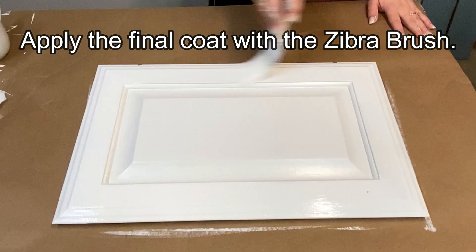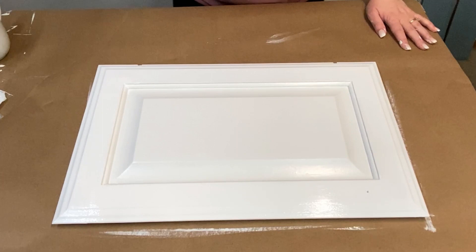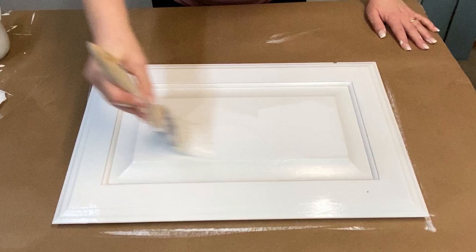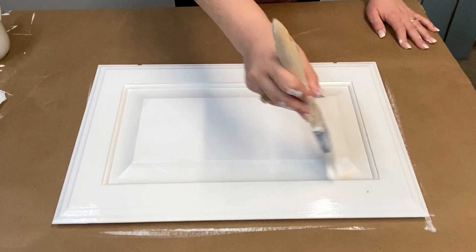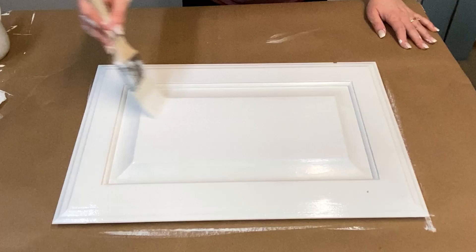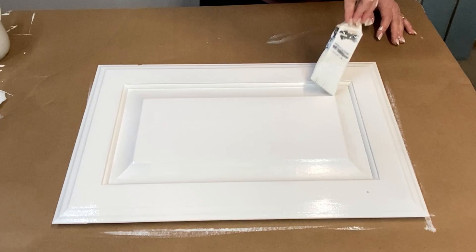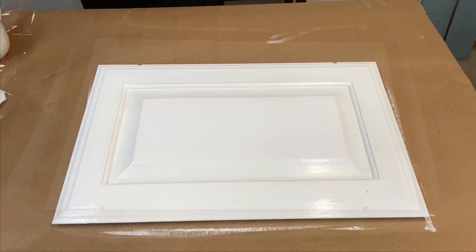Finally, we're doing the last coat of paint. Do this with your Zebra brush because this is the best way to get a super smooth final finish. When painting, always brush with the grain of the wood, especially right before you're done with that coat. At the end, be sure to wipe any drops of paint out of the corners so the paint doesn't collect there. Let this coat dry for 16 hours, and then if you see some places that are a little thin or not getting good coverage, you can just touch up those areas without having to do a full coat.